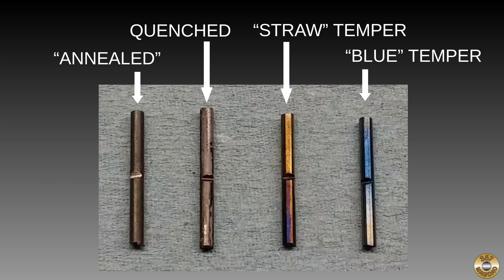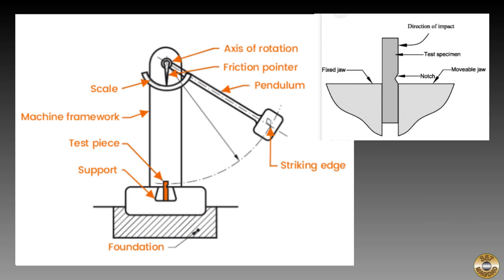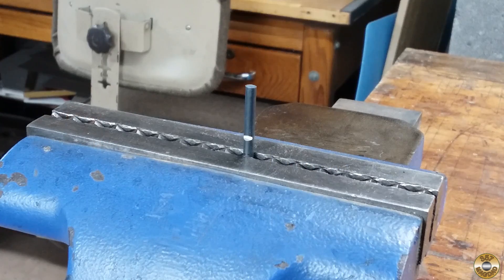I'm going to show the relationship between hardness and toughness. You want a hard material that will stay sharp and resist wear, but toughness — or the ability to survive impact — is also important. I'm going to demonstrate this by performing my own crude version of an IZOD impact test. The IZOD test machine consists of a pendulum with a weight at the end striking a notched sample. How far the pendulum swings through the sample is recorded on the scale.